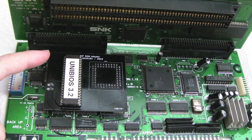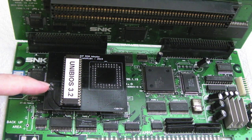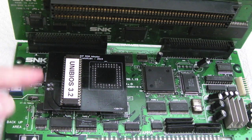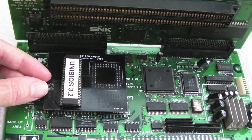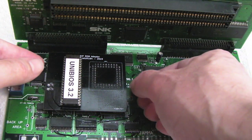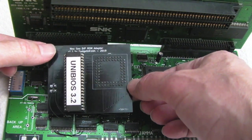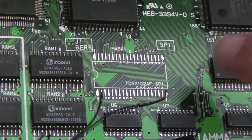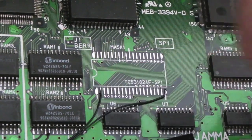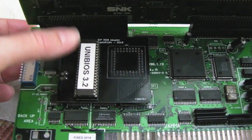So I think for the next revision I would have jumpers actually to detach these wires. I mean I could solder jumpers on, little pin headers and little sockets. Maybe have just a 2-pin JST for the 2 and then you could just plug it in and have your cables coming out. That might be how I would do this, but yeah, you can see it's pretty easy to clip it off, just carefully, just flip this over. Yeah, I can't get much cleaner than that, but you can see we've got nice clean solder points there just on those 2 pads.